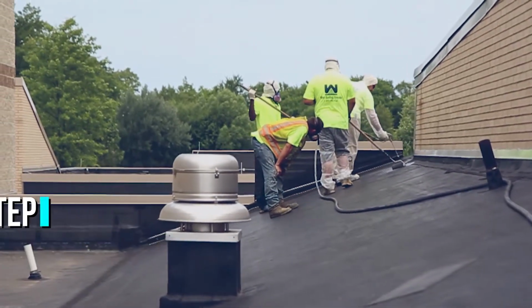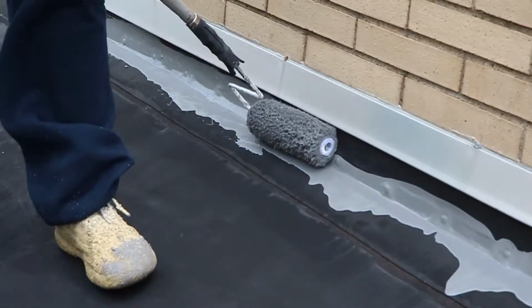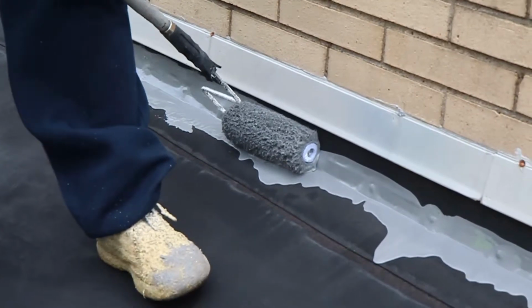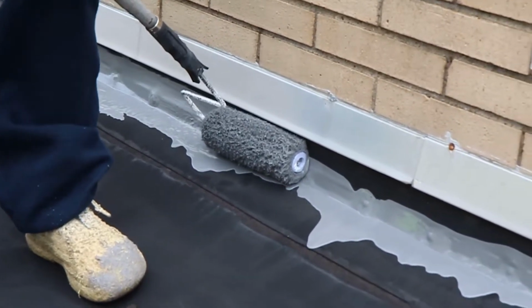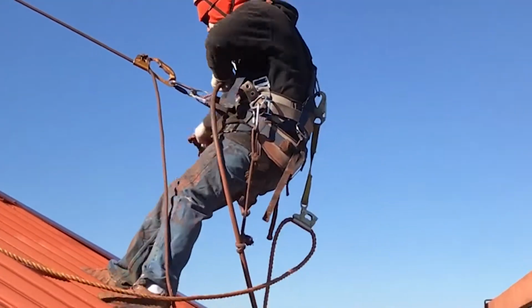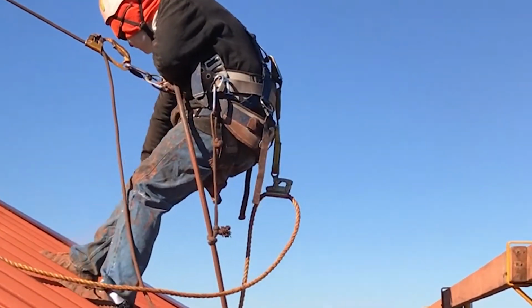The last step in an SRM, we're finally putting down the magic juice. We're getting the silicone coating on the roof system. Most applications are getting a 10-year warranty. Some will get a 15-year warranty, and even fewer will get a 20-year restoration membrane application. Manufacturers are very comfortable with the 10 and 15 years. We're getting on that outside edge of, is it really going to last 20 years?